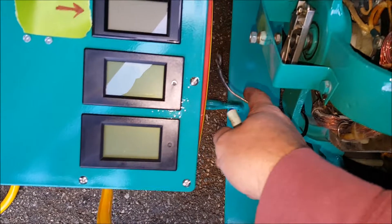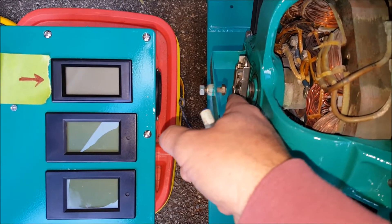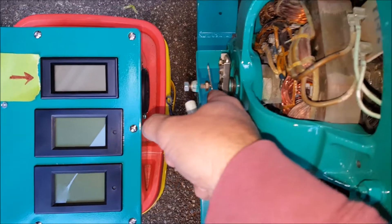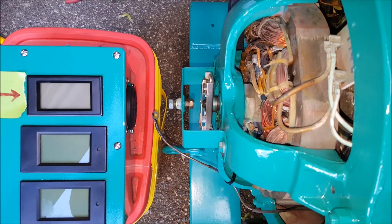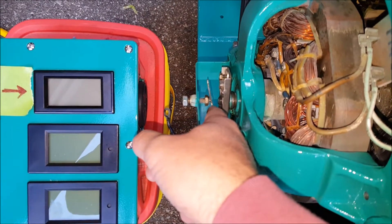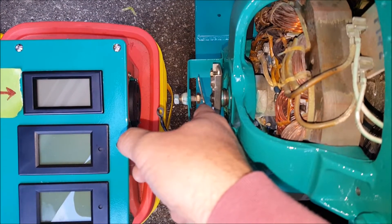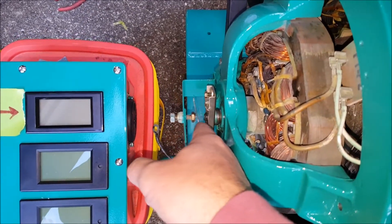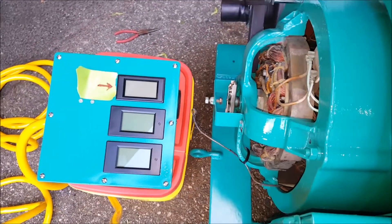The wire is not connected — if it was, it would kill the generator, and I don't want to kill the generator just yet, I'm just looking for the action of it. Also, when I shut down the generator manually in this case, I expect this arm to automatically retract. Some people don't care to have it retract — they'd rather leave it out in the field so they could diagnose the problem. But in order to reset it they would have to pull off the cover and go in there. I'd rather just hit the reset button over here, so let's start this generator up and see what happens.